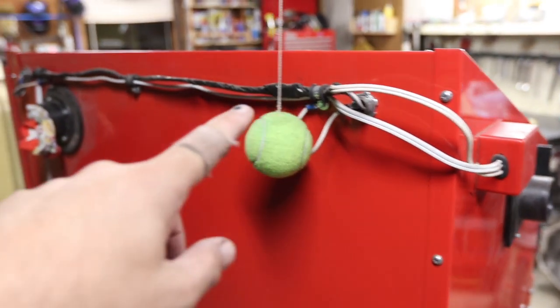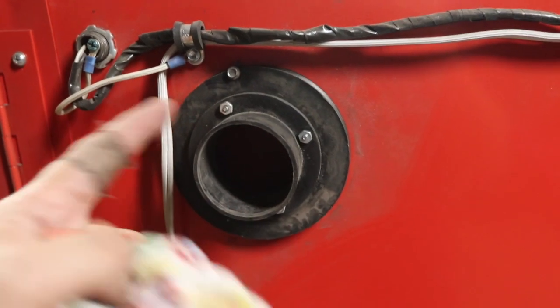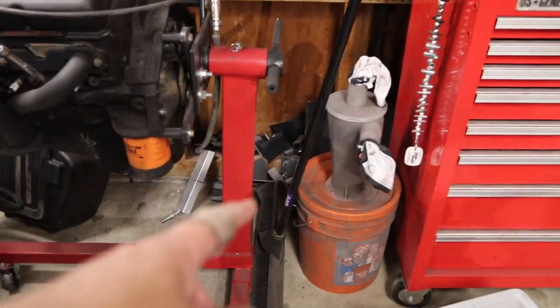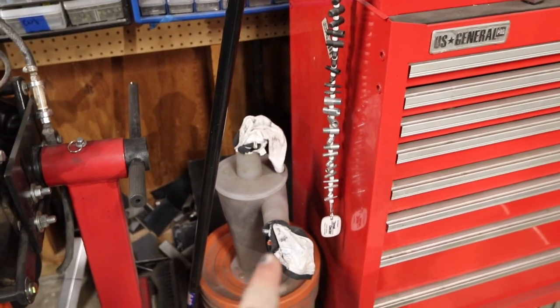This is how I wired my two lights. I took an adapter for a regular two-inch hose, like for a shop vac, and screwed it on there. Those hoses go to a bucket with a dust deputy on top. The vacuum hose goes on top and the hose from the blast cabinet goes on the side. That creates a vortex inside that takes the dust and drops it into the bucket instead of sucking it into your vacuum, clogging up your filters, and filling up your bag. It gets full after many, many hours of use. Very useful — key for this application. If you don't do that, your fines just keep getting recycled in your media and it's impossible to see. The dust deputy really helps out.